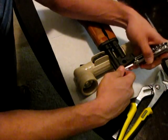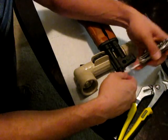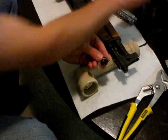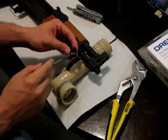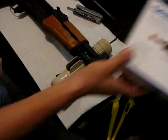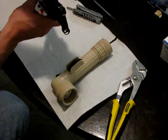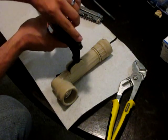So this wasn't hard, obviously you saw. All I did was cut it, and we took a look at the muzzle nut there — there's my cut mark. I didn't have to go very deep to get past the weld. The welds on the muzzle nut weren't too deep, maybe about a sixteenth of an inch, so it was real easy to go through. I used a Dremel 200, picked that up from Lowe's, and used the metal cutting bit. Went right through, and there's our finished product. I'm going to take a Sharpie marker and touch up these marks here.